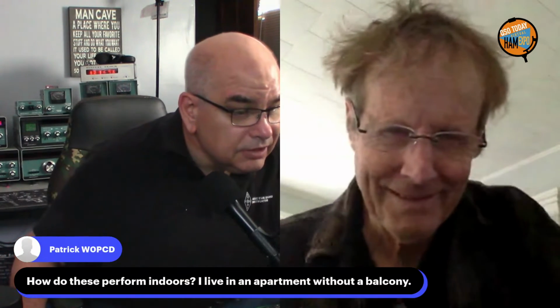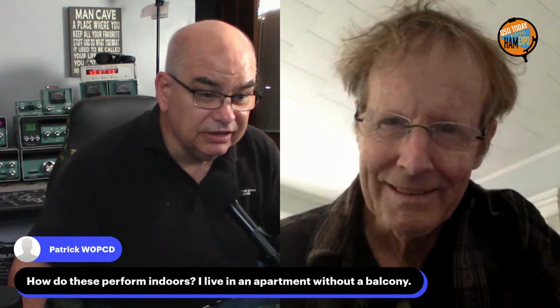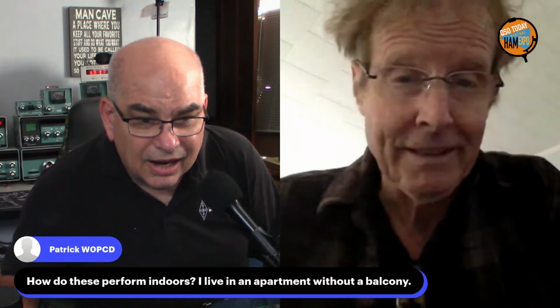And so let's see from Patrick, how do they perform indoors? He lives in an apartment without a balcony. Go ahead, Ted. Well, I had one in a metal hangar and talked to a fellow from France with it on 20 meters. So they do surprisingly well indoors. Of course, if you're going to run a kilowatt, you do need to beware of the safe distance to stay away from it. So try to put it at the other end of the room if you're going to run some power.